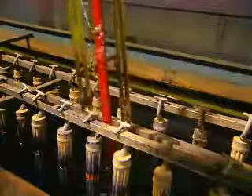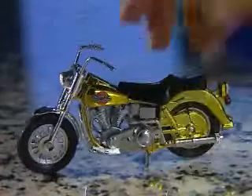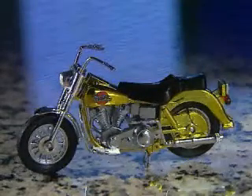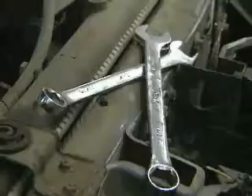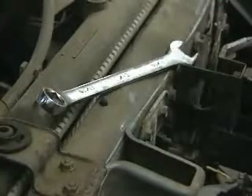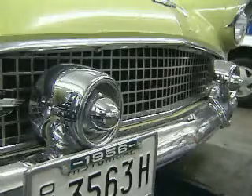When the desired depth of plating has been reached, only a final rinse and polish is needed. Even a thin layer of chromium provides the beautiful, lustrous finish. Objects subjected to greater wear need thicker layers of chromium. As an added benefit, the chromium provides a protective layer for the base metal beneath.